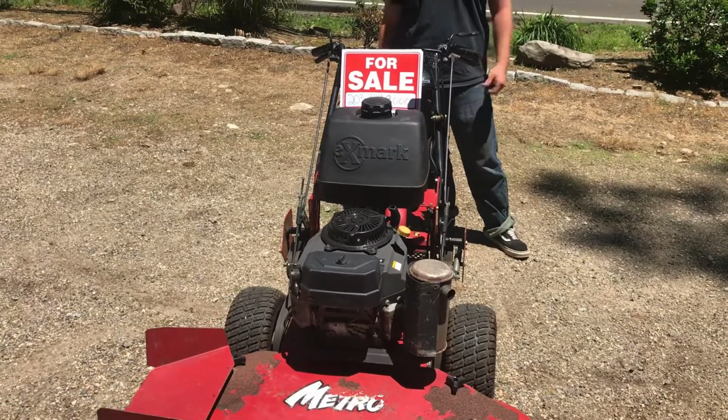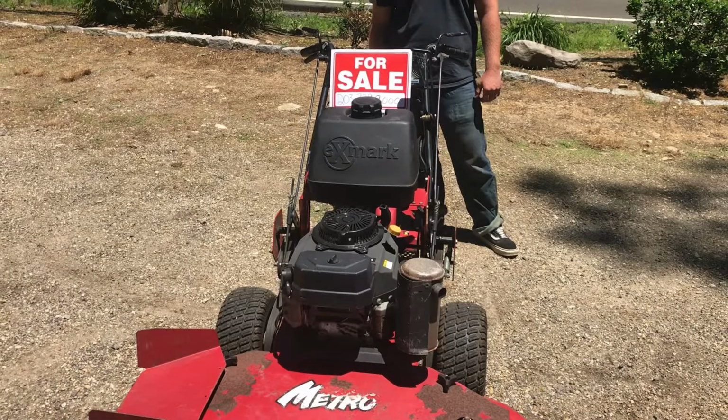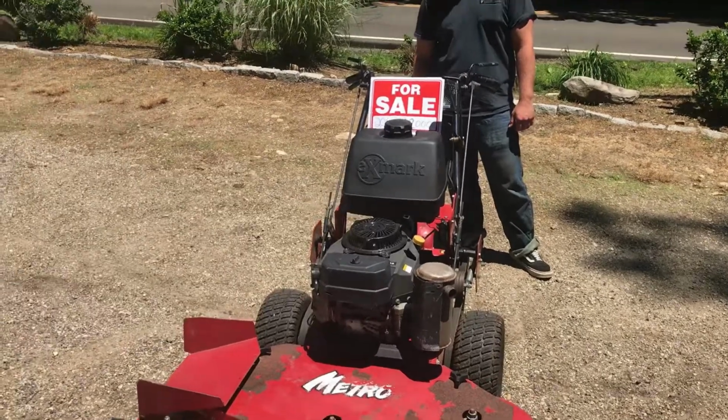Okay, so I don't cut in 5 because if you hit a stump or a rock or something, you're going to get it in the chest. And trust me, when you get it once, you'll learn. But if you've got a big field, a 2-3 acre field, and you know the terrain, put it in 5.